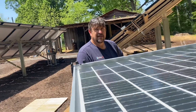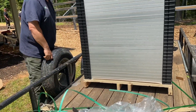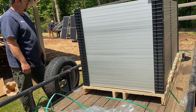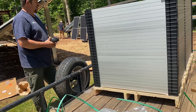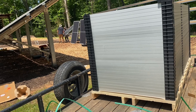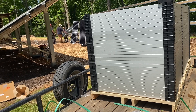All these people saying 'I'm gonna get 480-watt panels to save some money' — you don't save anything. There's a lot of weight here, and another problem with these huge panels is one person can't really handle them once they get much bigger. So you think you're saving money by getting the most efficient panels, but if you're not looking at the spec sheet you're getting something that's really difficult to deal with.